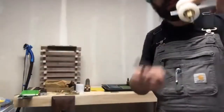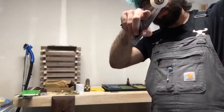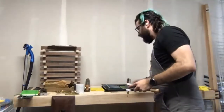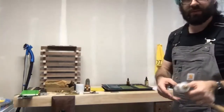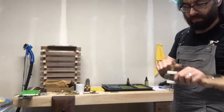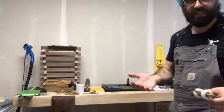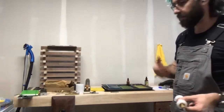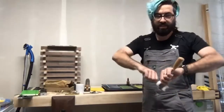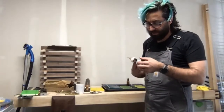And so I know that if I drag this across my abrasive surface, this tip here is going to hit at 30 degrees. Makes sense. And the exact angle doesn't matter. Consistency is what matters on the iron. I picked 30 because most of my things are ground at 25, and 5 more than that is really easy for me to remember, easy for me to look up. And I don't accidentally start sharpening this on the wrong thing and put myself in a spot where I have to take a lot of material off.